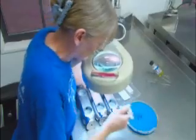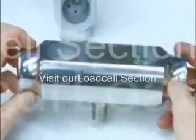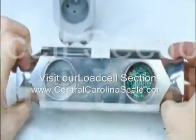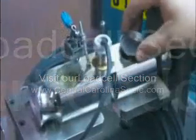There, workers delicately tape 4 strain gauges into each stainless steel load cell. Then they solder electrical wiring to each one. The wires all run to a circuit board at one end of the load cell. And from the load cell, wiring runs to the scale's computer readout.